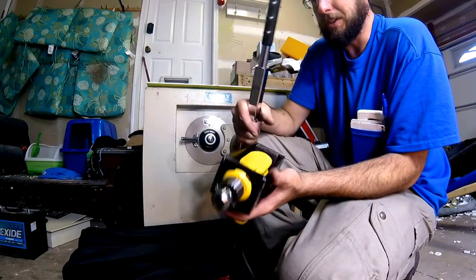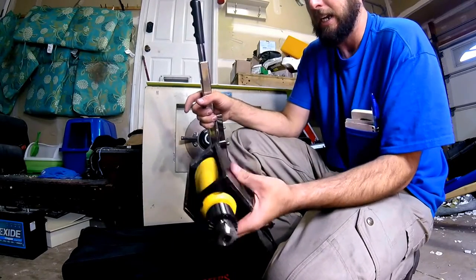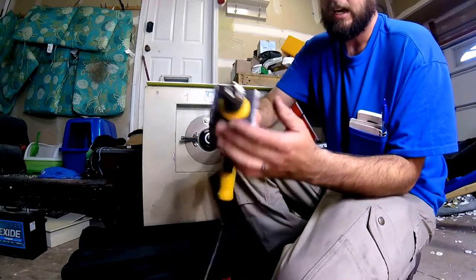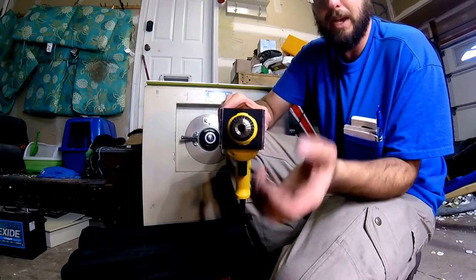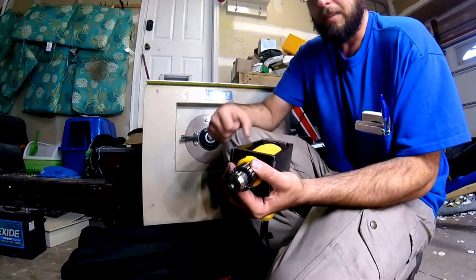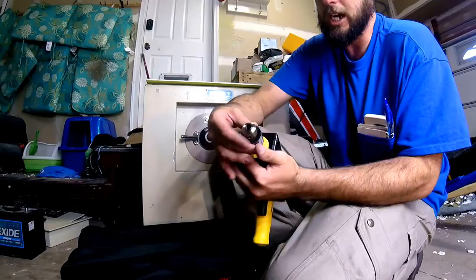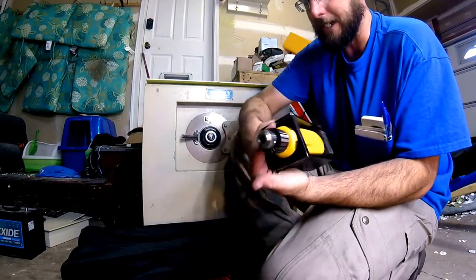This is a pretty cool little unit. This is all aluminum — looks like it's painted aluminum, or anodized — so it's a pretty light rig. You've got a DeWalt 3/8 inch drill with the manual chuck, which is nice because with the manual chuck you can really get clamped down on your bit. When you're putting that much pressure on there, you don't want to use a keyless chuck because you're just constantly gonna be having bits spin out on you.